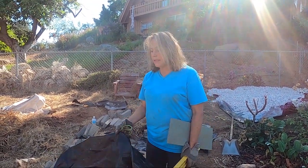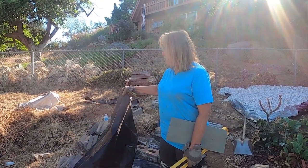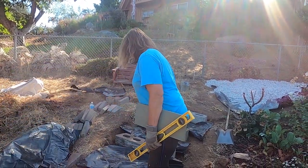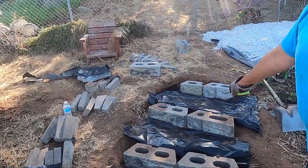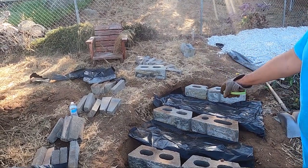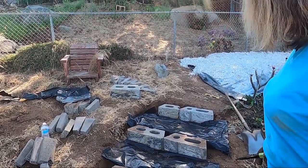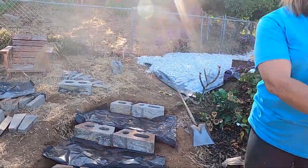Good morning — I've gotten all of my steps placed and leveled. The next step is this black plastic ground cover that I cut into a very long four-foot length and then cut into sections based on how wide it is, and simply lay it in where the steps go. The next step on top of that is the rocks which will level it all out, and then we put the capstones on with cement. I've gotten two and a half steps done and I'm going to keep going down.